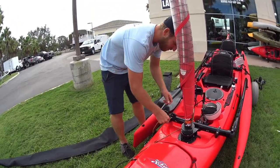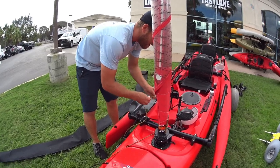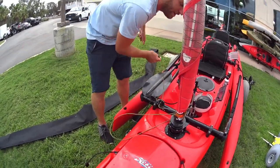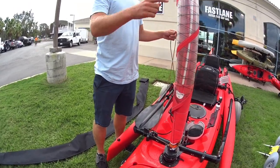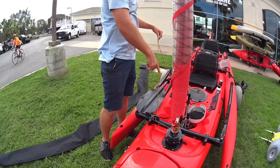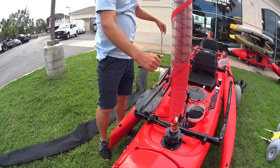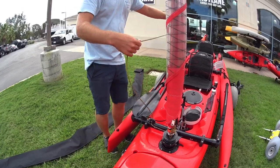This yellow line — the furler control line — goes here. Tie a little knot so it can't loosen itself all the way. Basically this yellow line and the sail are always opposites: when the sail is unrolled, the yellow line is all rolled up; when the sail is rolled up, this is all out.